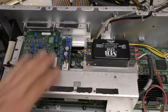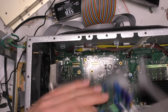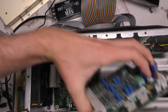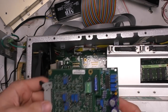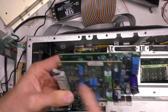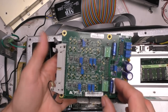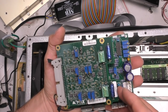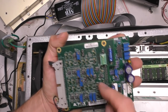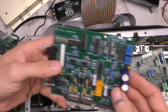and then just a bit of metalwork, and then the main board's underneath. And there's a heatsink on the back of here, and I think this is the drive for the XY mirror. It says on the board current stroke PSD, so PSD is probably the position sensitive detector to sense the position of the mirror. There's just a load of adjustments and op amps on this top board,